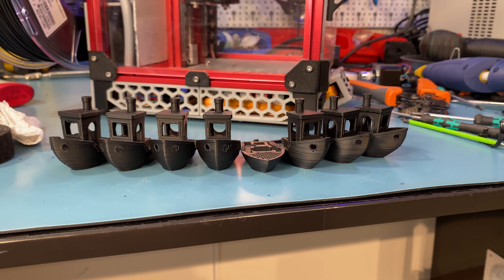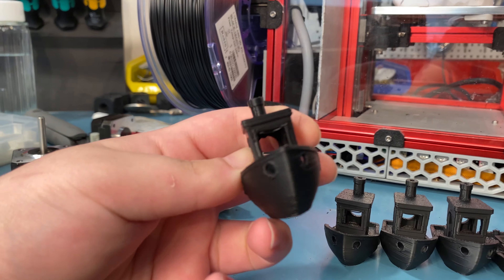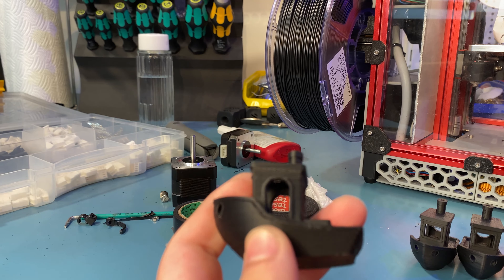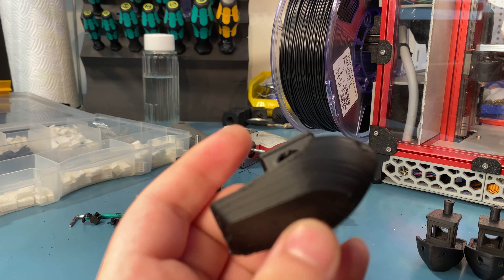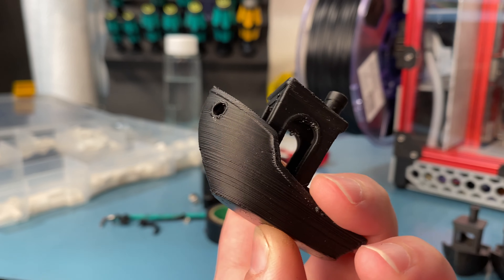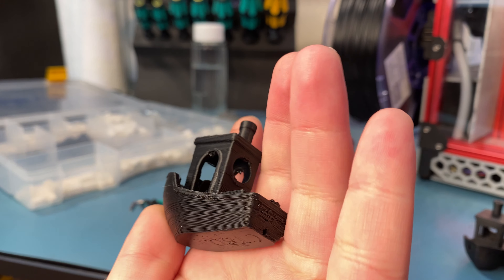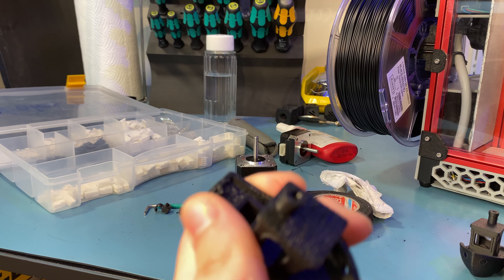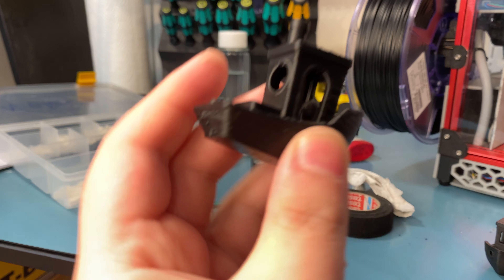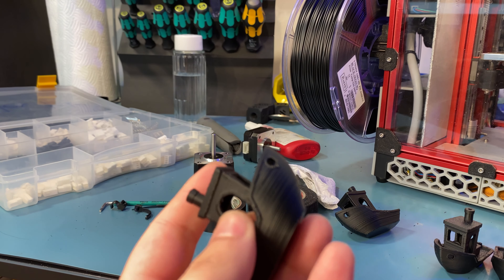The testing and printing is done and our fleet is here. This was the first print with the belted Z drive, and this was with the belted Z drive and pocket watch. You can see it doesn't look that good — vertical lines, extrusion problems, and some bridging problems. The easiest way to tell with the earlier prints is the text is just a random collection of zits; the later prints still aren't readable but look better.